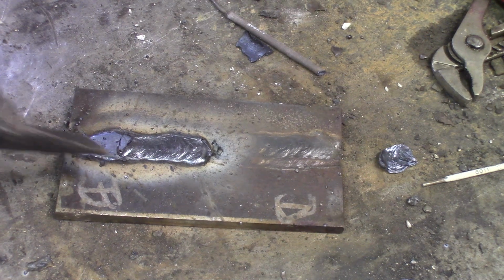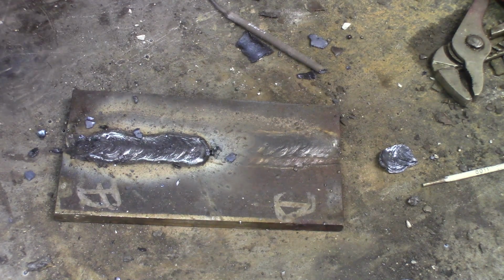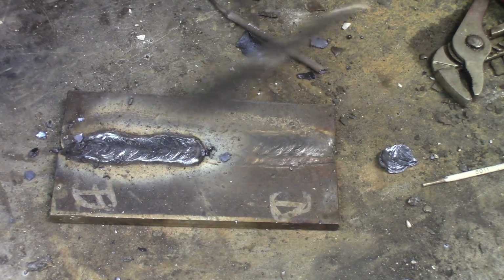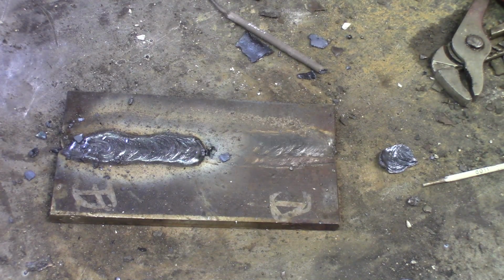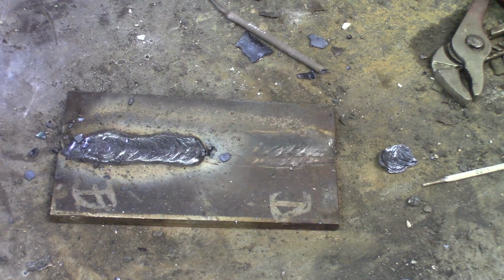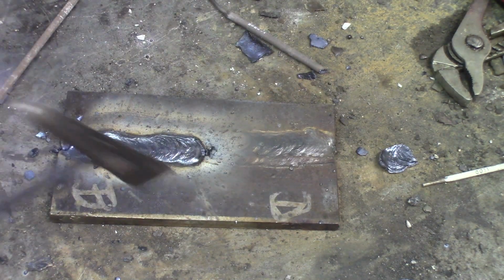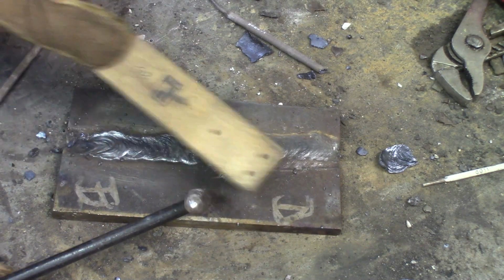Pretty sweet. That's pretty sweet. That's 1 pass. You did both. What do you think of that? I got no dome on it. It should be a little higher. I could go for another pass. I should be having a dome on this. That's no cheating. That's another kind of rod. It's nice though. It's almost as nice as mine.